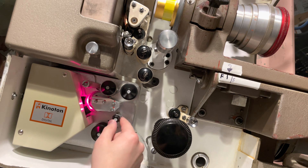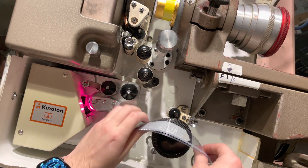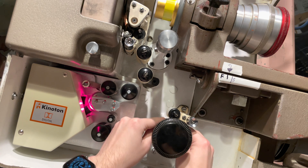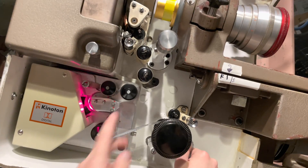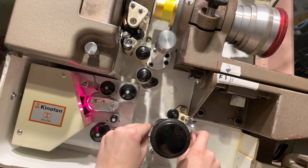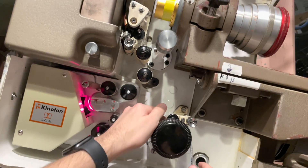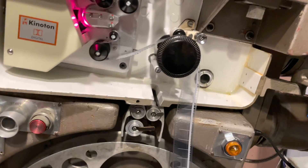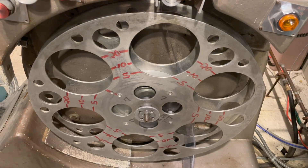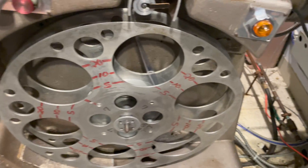Then we come out back around under here and we come to this moving one right here. We go around it and come here — notice how it pulls on there. We run this film up to right here; this is the last one that goes through. So we open that up and put our 35 millimeter film onto the sprockets. Now we want to check over here — we don't want too much tension. For our projector, you want just a little bit of clearance from that first notch, normally about one sprocket hole worth. Then we close it and check it with our fingers again. We go through the last set of rollers, and at the bottom we wrap the film around, tape it onto the bottom reel, and give it a nice little tuck.